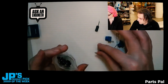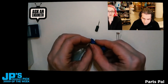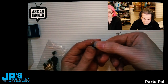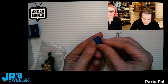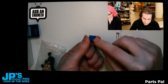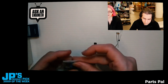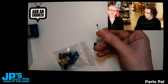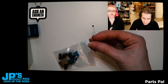These are super common. You get a 1 kiloohm potentiometer. So these are nice breadboard-friendly potentiometers, with the twisty knob. And you get a 10K one. So you get 1 1K and 1 10K. So it's kind of nice, one of each. And a nice knob with an arrow. Again, breadboard-friendly. You can use it with that solderless breadboard. All this stuff is breadboard-friendly, which is kind of the point. You get a 10K thermistor. It's not as nice as an analog out temperature sensor, but we have a code example.